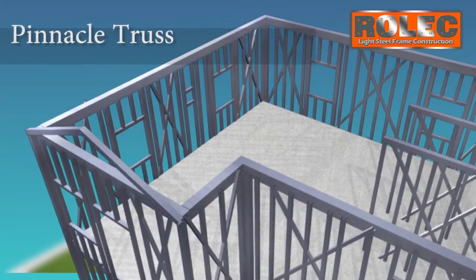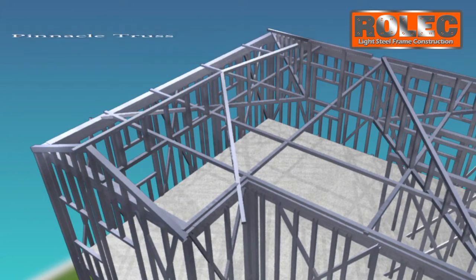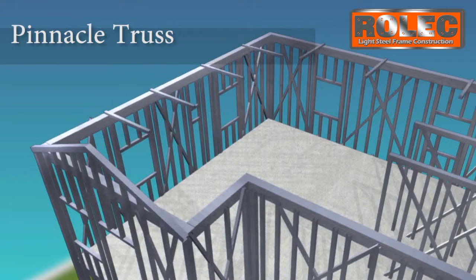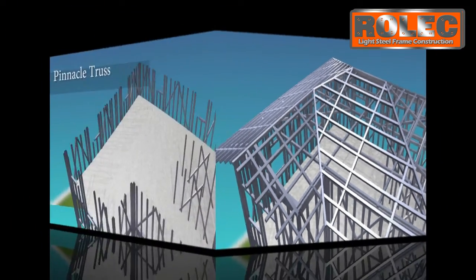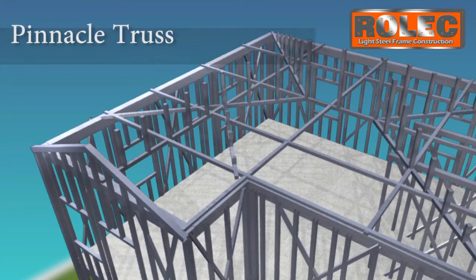The Pinnacle roof. Option 1: Same as the Pinnacle floor but with the concrete topping at an incline, or with the top profile of the joist at an incline for rainwater drainage — waterproofed in both cases. Option 2: Trusses from light gauge steel with top hat purlins and roof covering of choice. Option 3: Portal frames from large light gauge steel profiles with light gauge steel purlins and roof covering of choice.